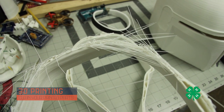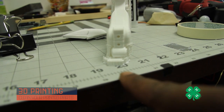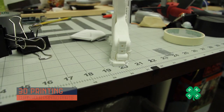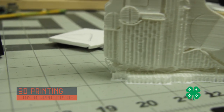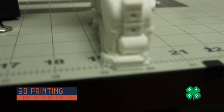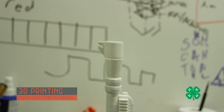One of the problems you'll experience with 3D printing are failed prints — you'll get plastic all over the place, sometimes overhangs caused by printing in open space with no support. This part of the base shifted to the right at some point during the print, causing stringy spaghetti-like support material in the back. But luckily because the whole bottom part of the blaster is support material, it really didn't affect the print — everything else came out super steady and ready to go.